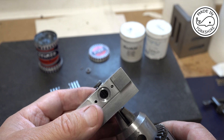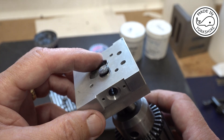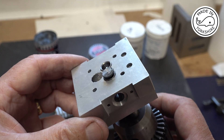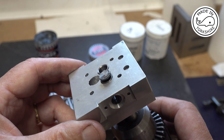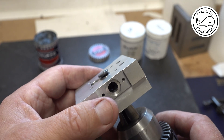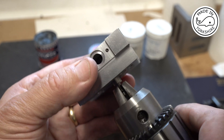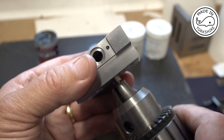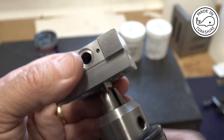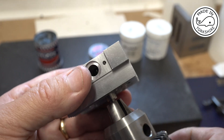I've put some fine grinding paste on. One thing I wasn't sure about is these guides are made out of mild steel, which I thought was a bit odd — it's as per the drawing. I've usually made them out of phosphor bronze, but I've learnt my lesson previously: always stick to the drawing if you can. So it's just a matter of running through the grades and then giving it a bit of a leak test. I'll go through, probably use the 500 and maybe the 1000, then repeat the same process on the other valve.